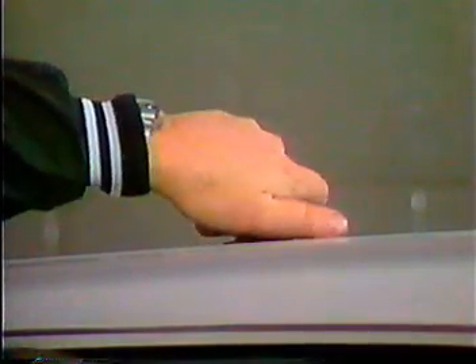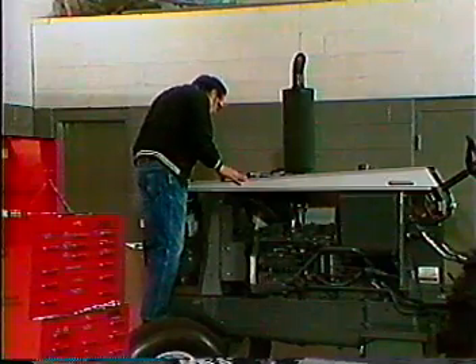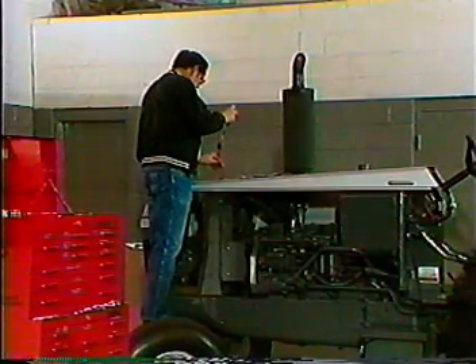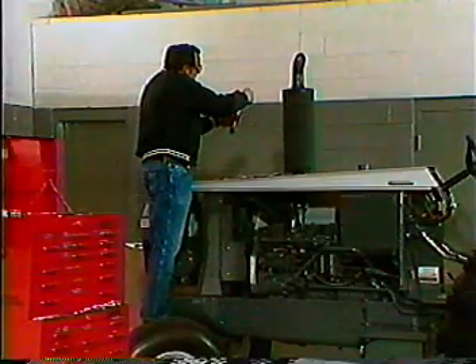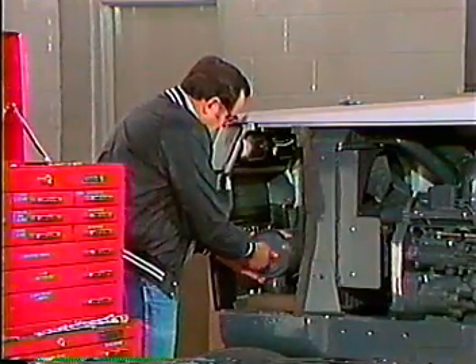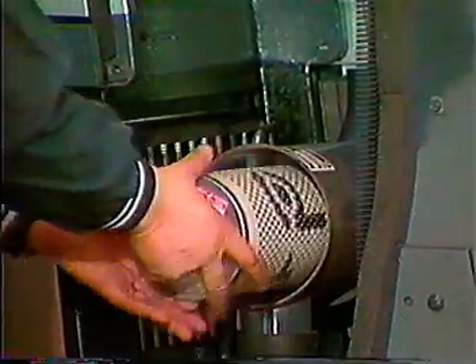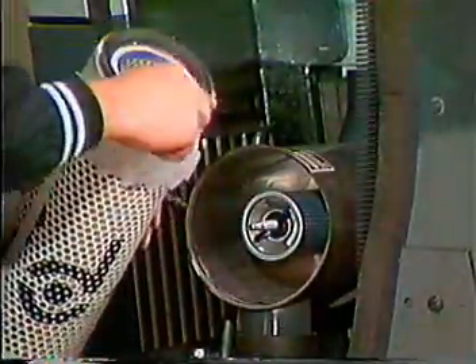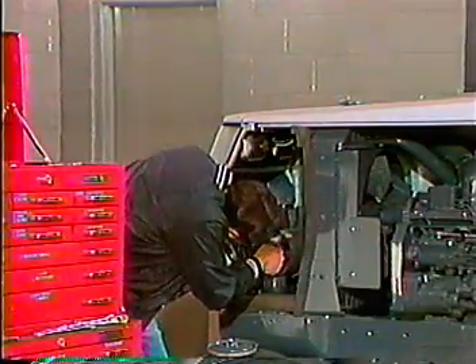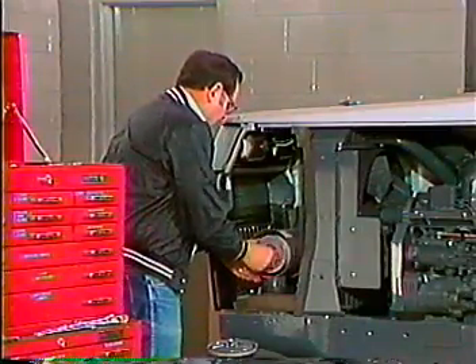If the engine is hot, a quarter turn to release pressure is required before removing the radiator cap. Inspect the coolant level — it should be about three-quarters of an inch below the bottom of the filler neck. Use an antifreeze tester to check the freeze level of the coolant solution. Remove the air cleaner end cap and then the primary filter element. Inspect the filter for damage, paying particular attention to the end gasket. Then check the secondary element to be certain it is in place and tight. Reinstall the primary element and end cap.